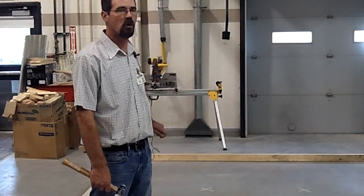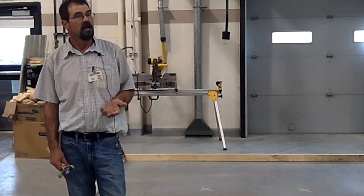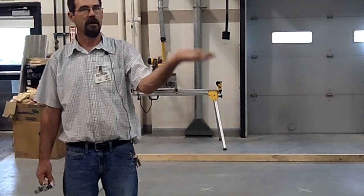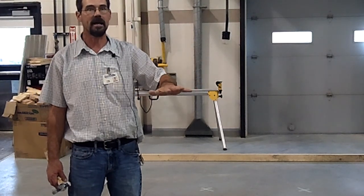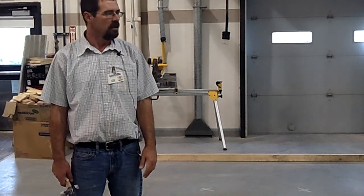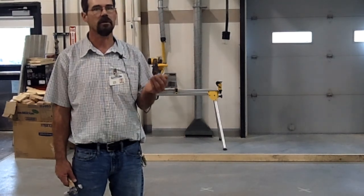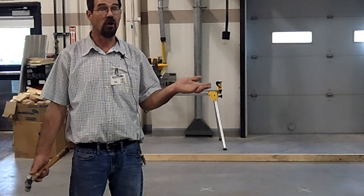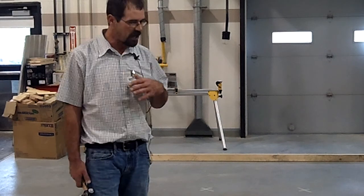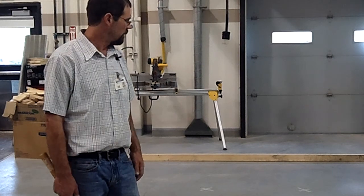But plus, if you sprayed that down with water before you poured, that would slow that curing process down, where you would have better concrete. Then you've seen after it got so hard, he was spraying it with water on top. Some people take fan sprinklers and put them out there after it's hardened, where that's not going to damage it, and they'll just let that sprinkle on it to slow that curing process down. Actually, concrete takes a long, long time. It constantly keeps getting harder and harder as years go by. It doesn't stop. It's still curing, a lot slower then. But that initial curing process, if you can slow that down, you have a lot better concrete.